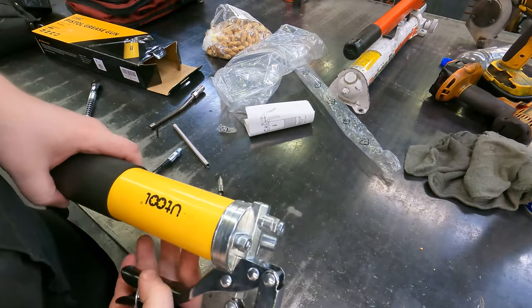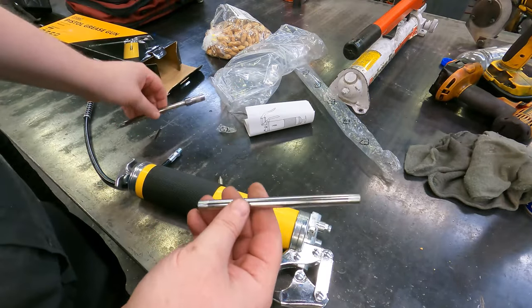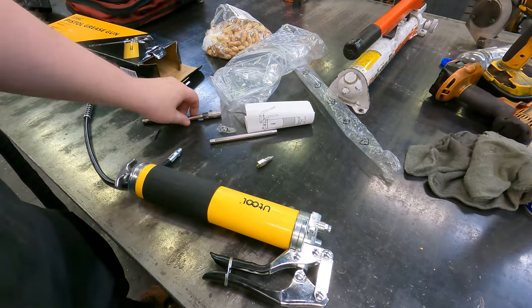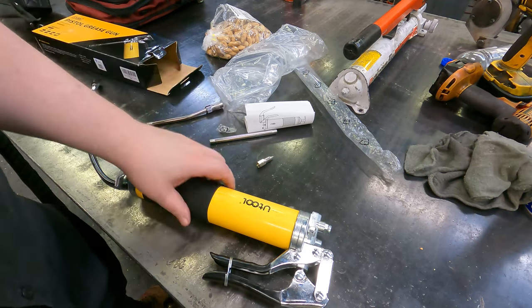I use a lot of grease guns — it's just the way this thing goes. We actually have a second stiff nozzle holder, and we have a precision tip. So if you just need to get grease inside of a bearing or something like that and you're not going to be attaching to a Zerk, use that.